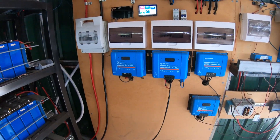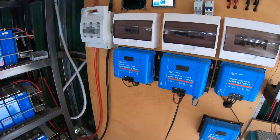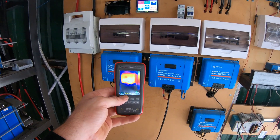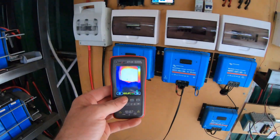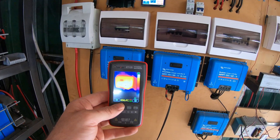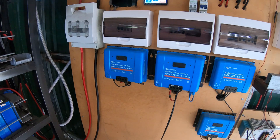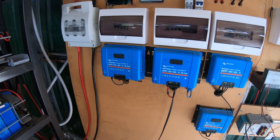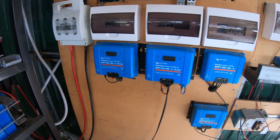Morning YouTube, it's been a little while since I made a video. Currently overcast out, we're not producing much power. I'm getting a little bit concerned about the amount of heat this MPPT is producing. It's within spec and appears to be working okay, but there's nearly 60 degrees coming out of this thing — 58.6, 59.3 — so yeah, it's pretty warm. I really want to bring that temperature down to make sure this thing lasts its expected lifespan.